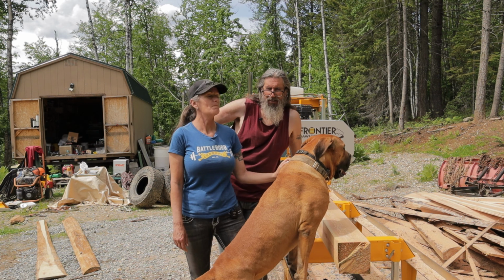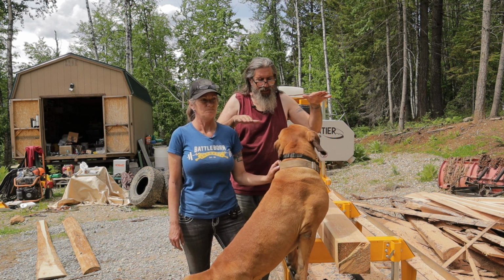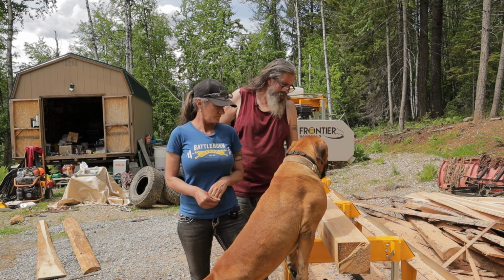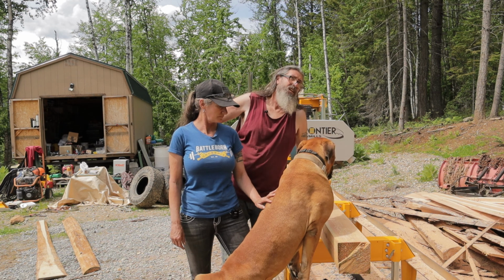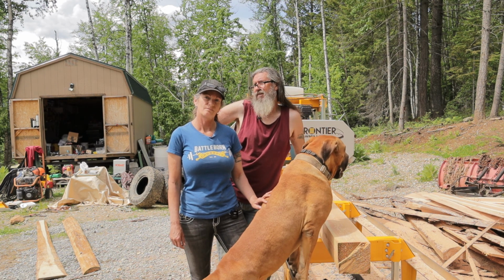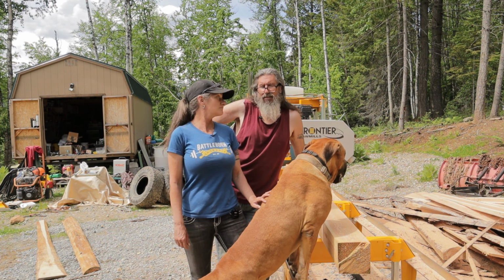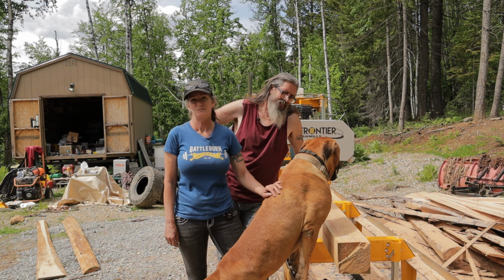We're a little bit off still. I think the head's got cockeyed like this because we're like a 1/4 inch off from one side to the other side. So I'll stick my awesome measuring device under there again, which is a 1, 2, 3 block. And we'll go from there and figure it out.